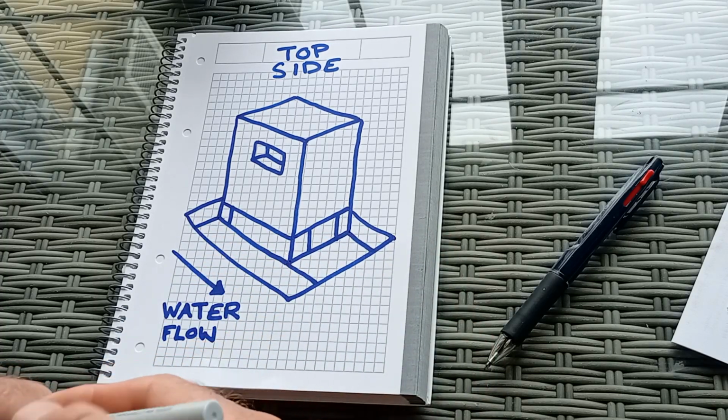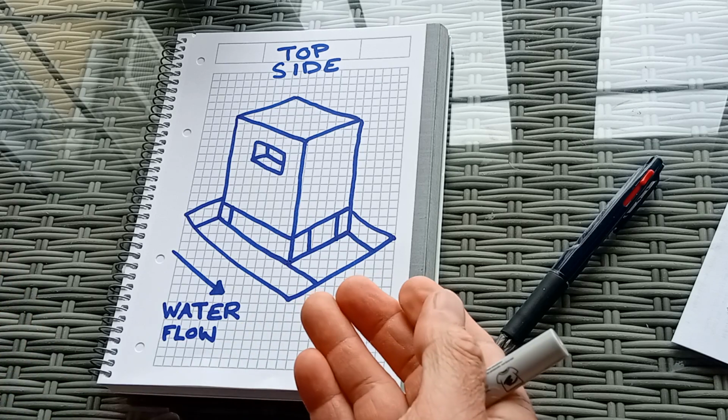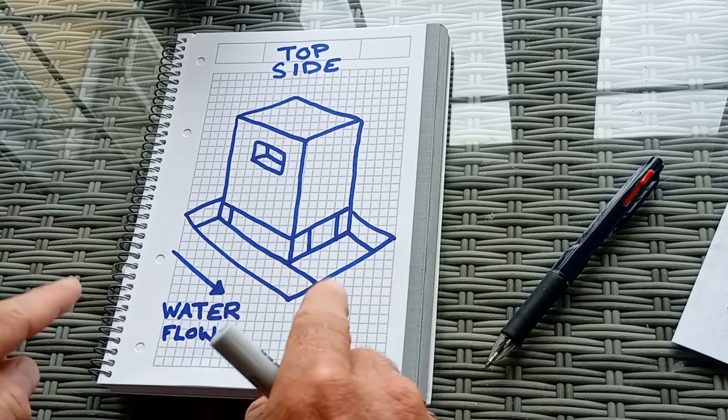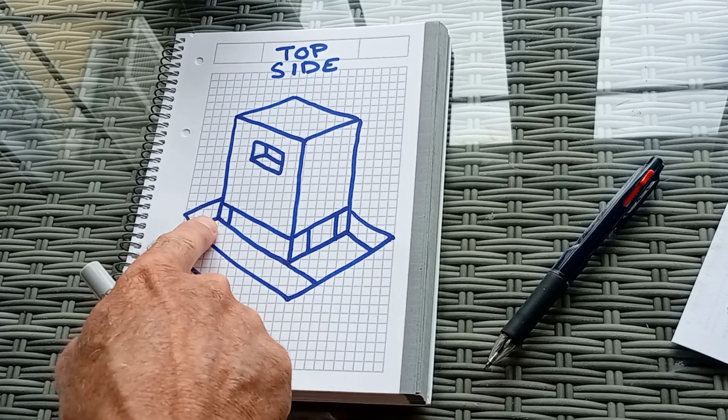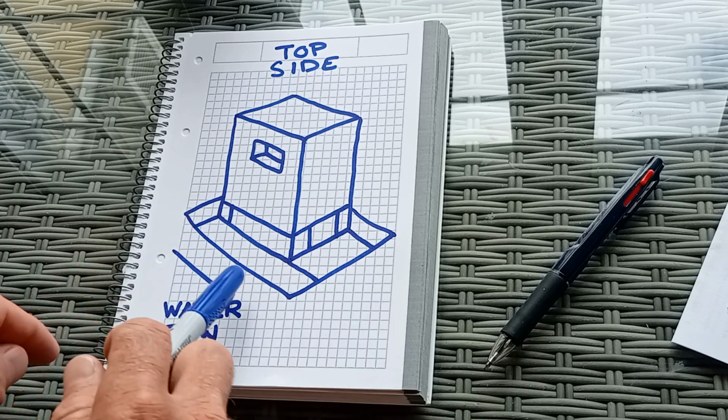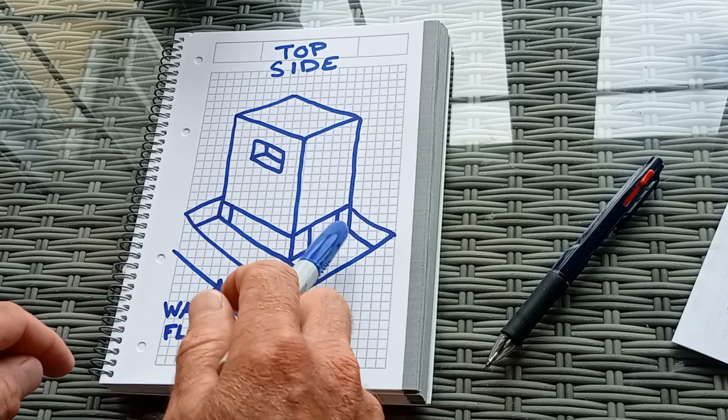Typically with metal or asphalt shingles, you're going to put roofing cement underneath the flashing and let it bleed through, and then again on top, and that will cover these points here. For the flashing that we're using, we're going to cover the whole area with a sealant.